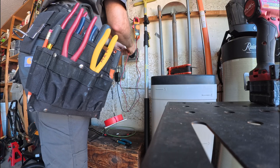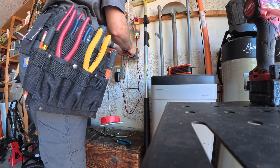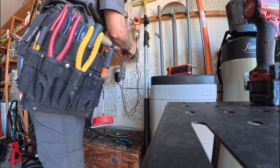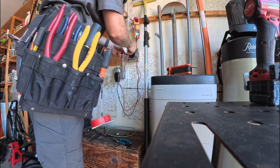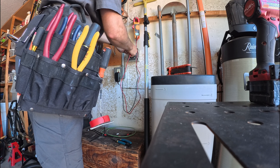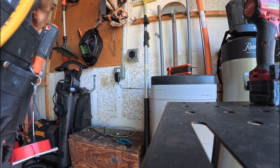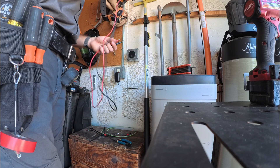Nothing blew up, which is good. So we got 246 volts, 120, 120. Hot to ground 120, hot to ground 120 — perfect. Everything's looking good. I'll gather my tools and present this to the customer. So we have another successful installation. The customer was happy. Her son will be able to weld in their garage. The welder is a 30-amp rated welder and the outlet is rated for up to 50 amps, so that's going to be plenty sufficient. She left a nice review for me. Thanks for watching and see you at the next one. Ciao.